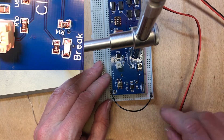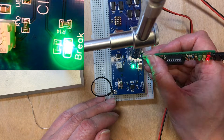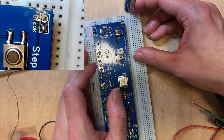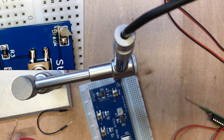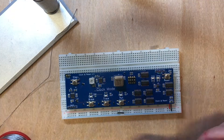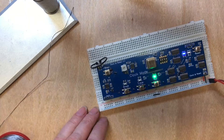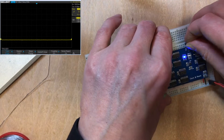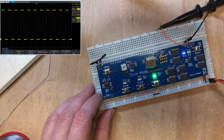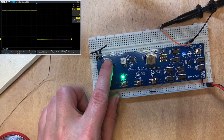That appears to work — why doesn't that? That's supposed to be a ground connection. It really is just acting like this pin's not connected. This is one of those older bars without the cross connection. That looks to be correct behavior. We should have a clock output there and next to it on both sides we should have a ground line — a nice clean clock signal.